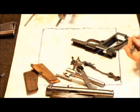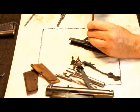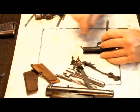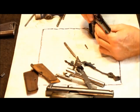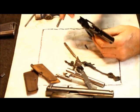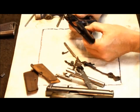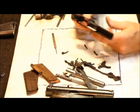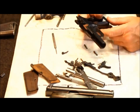The gun, virtually one more item here. We have to remove our trigger. I go from the right side to the left, tap out the trigger retaining pin, and then rotate it up. Here's the connector here. Reach in and pull it out. And then rotate the trigger down and push in on the plunger and rotate it out the bottom. So the clip is torn down, the frame is torn down completely and ready to blue at this point.